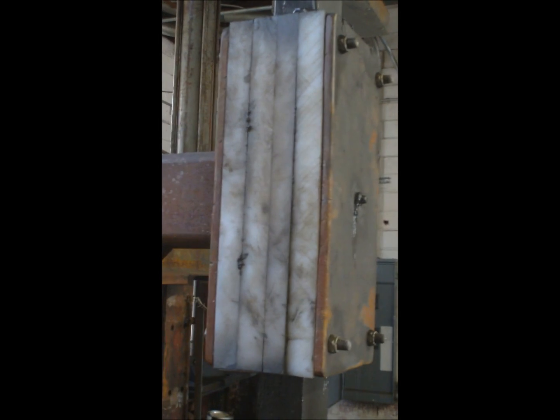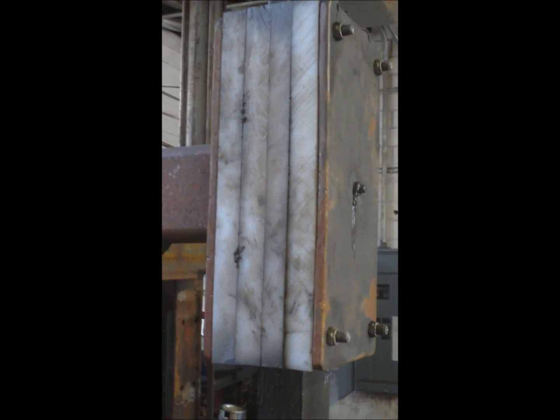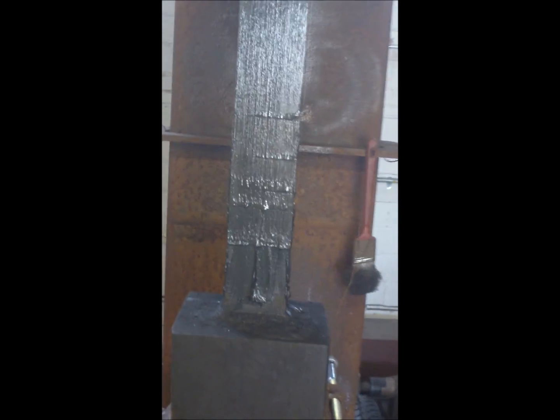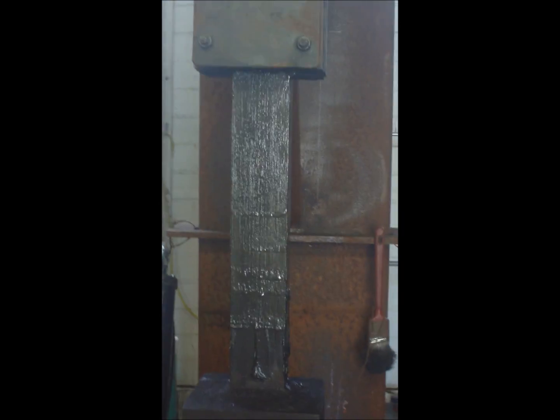The guide is made from ultra-high molecular weight plastic, which is very slick and has better wear resistance than steel. I've also added a greasing system — there are channels machined into the plastic that let the grease go all the way around the ram, and every once in a while it just needs a little bit of fresh grease. The ram itself now weighs approximately 100 pounds, not including the weight of the die. So it hits pretty hard, as you'll see later on in the video.